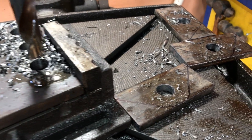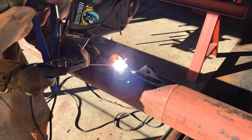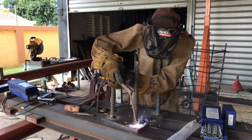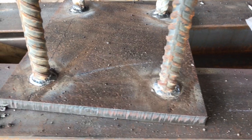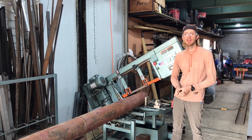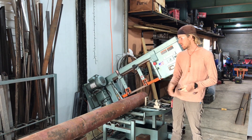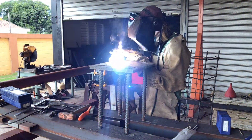I think the line is going to attach around 15 or 16 feet up, but leaving it longer gives me more options in the future. I got a three-quarter-inch base plate that I'm going to be trimming up with the plasma and getting the attachment points connected to the rebar. I'm not going to bury the post because posts are pretty expensive. The concrete and rebar comes out potentially a little cheaper, but I also don't really like the idea of just burying pipes in the ground. So let's get on with the project.